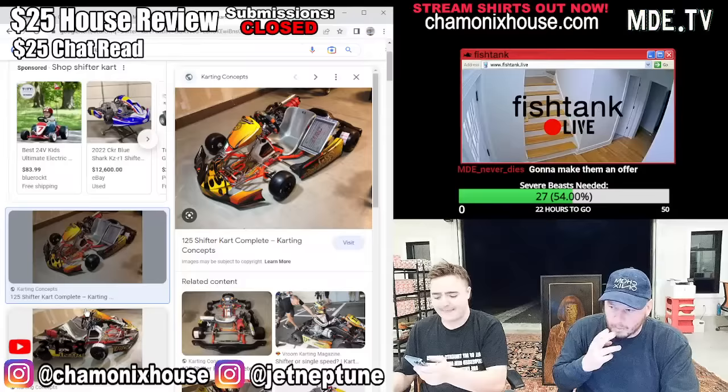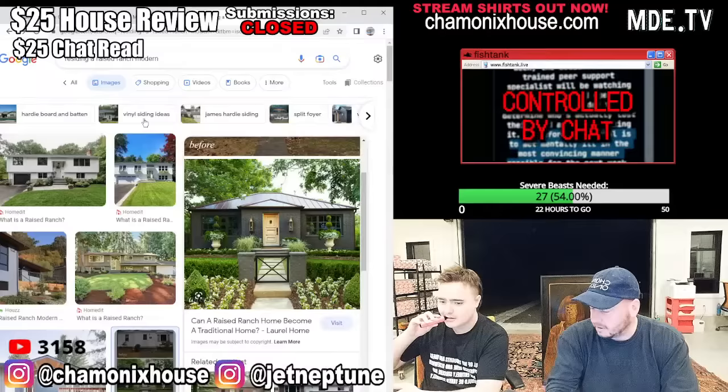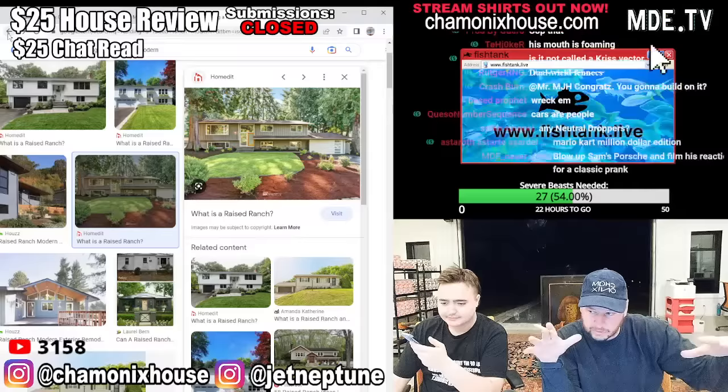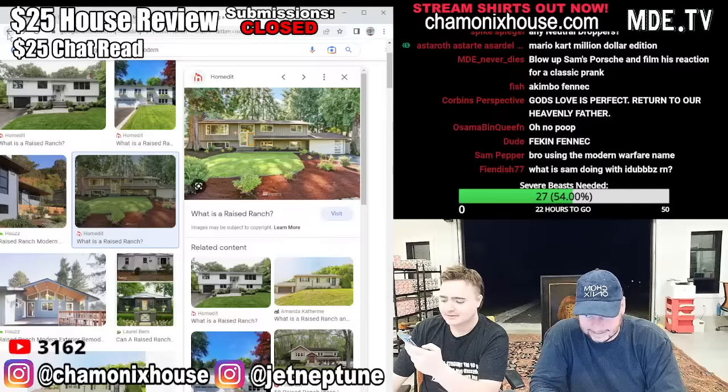Go to a lumber yard. Make a deal with a sawmill, like a low budget sawmill, if you can clad it cheap and quick. If not, go all plaster one shot. Have sheetrockers come in, get the whole thing like a studio white. But do run really considerate recess cans, 2-inch recess cans, 3-inch recess cans, all over the place. Make it look like an all white art studio. That would be dope. And then cost it out with 1x12 pine painted, 1x10, 1x8, 1x10, pine painted. As cheap as you can find it.